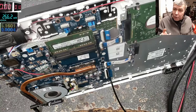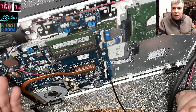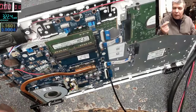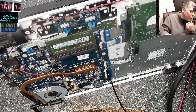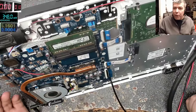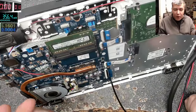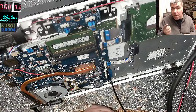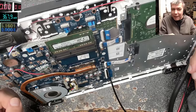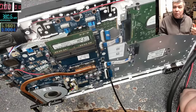So I suppose that 5 volts power supply is built on that idea. When you design a 5 volts power supply, I will design it so that if I connect a phone on each port, and I have 3 ports, the laptop should be able to supply like 1.5 amps. So already I know that power supply will drive my 700 milliamps. Maybe if the customer connects a phone on each USB port, the power supply will protect itself. It will cut the power. I don't think so, because it's more.